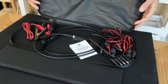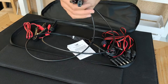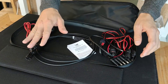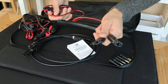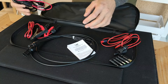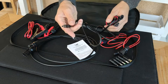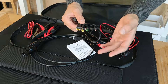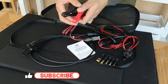It's really easy to open up, and inside you find a lot of cables that come with this solar panel. The main cables are MC4 connectors, which I really love — it's the industry standard for solar panels. You also have a bunch of different connectors: MC4 to Anderson connection, which is really handy for different use cases especially with some power stations; MC4 to DC; and five different DC adapters so you can connect it to basically any power station out there. And finally, MC4 to ordinary clamps.